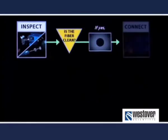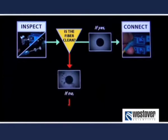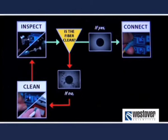There are a number of actual cases where proactive inspection and cleaning would have saved companies considerable time, money, and resources. For instance, a Tier 1 service provider deployed fiber to the home and connected customers with voice and broadband internet. In doing so, the installer paid little attention to fiber cleanliness. The customers were initially pleased with the service until two months later when video was switched on and the service would not turn up. In troubleshooting the problem, the provider had to go back and clean every connector between the customer and the central office. Once the last connector was cleaned, the system turned up without further effort. Had that provider proactively inspected and cleaned each connector during the initial installation, they could have avoided losing valuable time and money in deployment, troubleshooting, and dealing with unhappy customers.